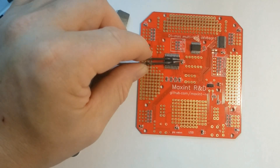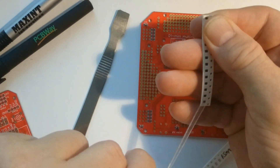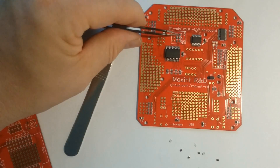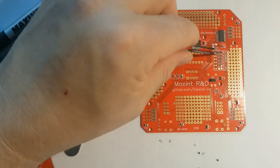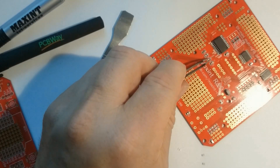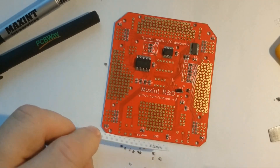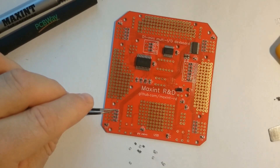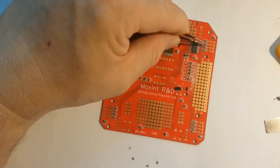After placing all the different capacitors, I continue to do the resistors. As you could see, they kind of jumped out. Most of these resistors are pull-up resistors — there are 10K resistors placed at the I2C address lines and as pull-up for the I2C data input. Then there's a whole series of resistors next to the PWM output. Those resistors are used so that you can add LEDs directly onto the board — they are current limiting resistors to allow for direct LED connections.